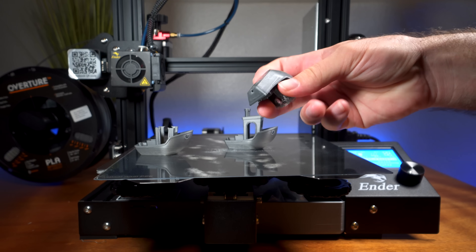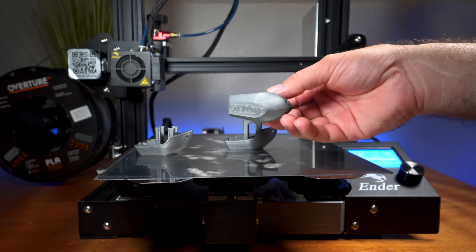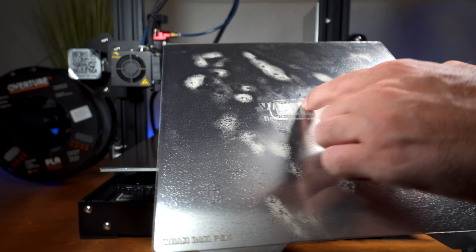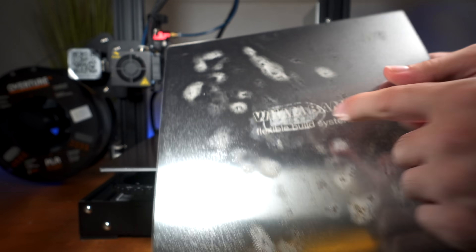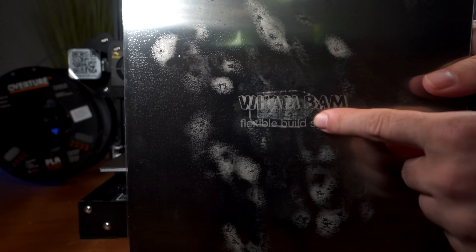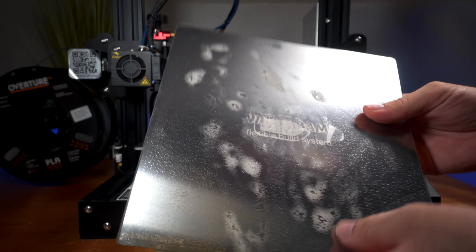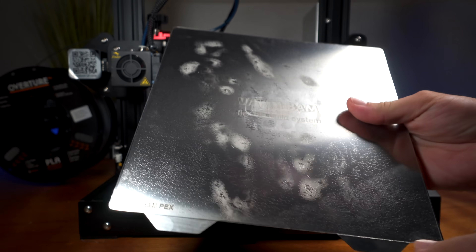The second Benchy is done and it looks really good. The plate lifts up easily and flexes well. However, I had to use glue — the first Benchy fell off because I didn't clean with alcohol and the nozzle was too far from the bed. The second time the nozzle height was good but it still wasn't holding well enough and knocked off. The third print I applied a tiny bit of glue and this time it stuck perfectly.